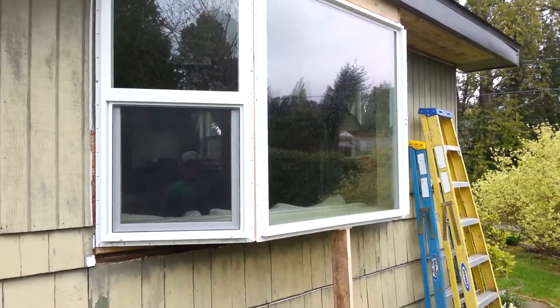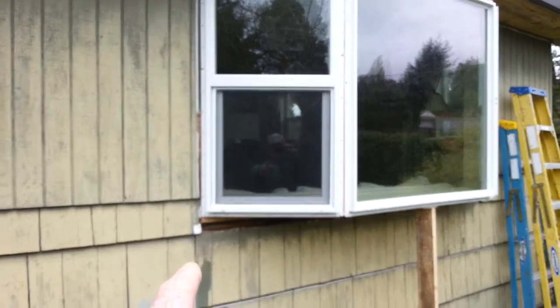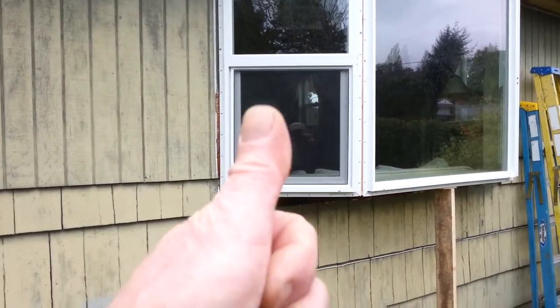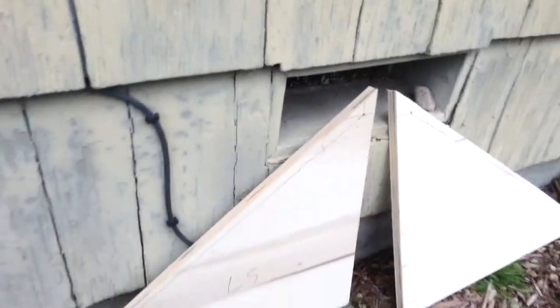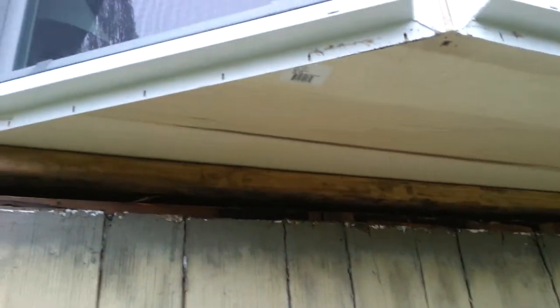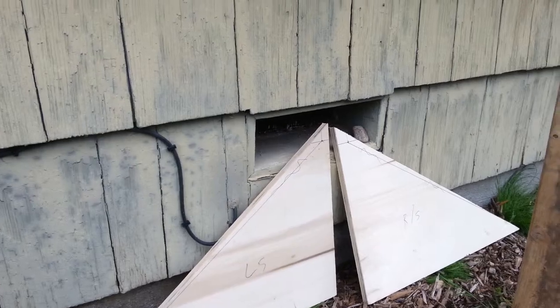So what we're going to do is take these windows out again real quickly, and then we're going to put a shim underneath here just to raise the window up a little bit — only a quarter of an inch. I've also decided I'm going to add another three-quarter inch piece of this poplar plywood to the bottom. These are my cutoffs from this original piece here, so I don't have to go in and use a sliding T-bevel to figure out the angle again. I can just put this thing up in here and get my exact angle — it's 15 inches wide — and we're going to rip that piece, then take these in the shop and match them up and cut those angles off on the new piece.